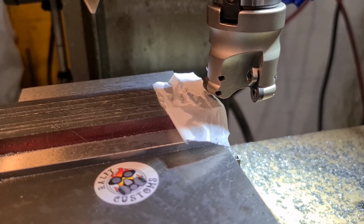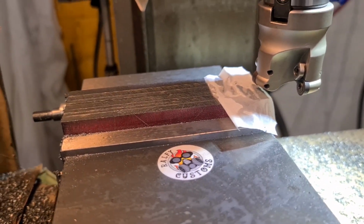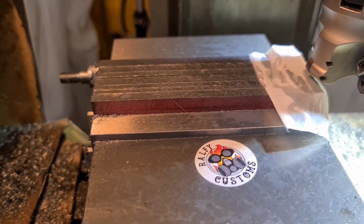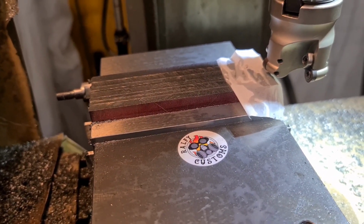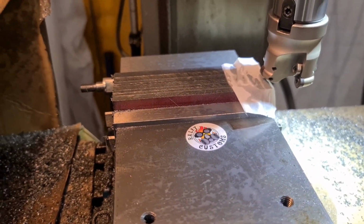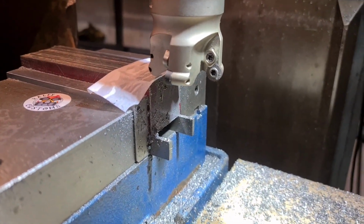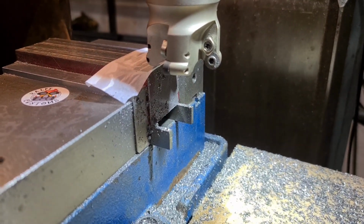I'm going to end up losing track of which surface is which, and I don't want to end up with a roughing out finish on a surface and struggle to make it look pretty, because I've machined around it and now it's not easy to hold. I don't want to lose track, so I'm going to give it a quick skim round, and I'm going to do the ends as well. I'm going to side mill the ends with an end mill. So we'll get that cleaned up.